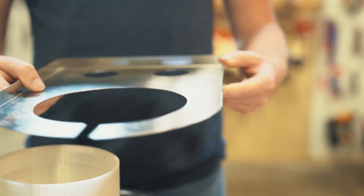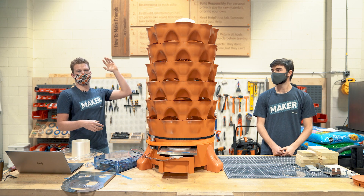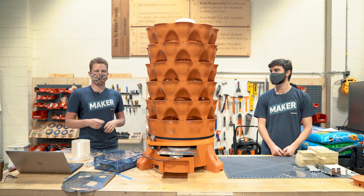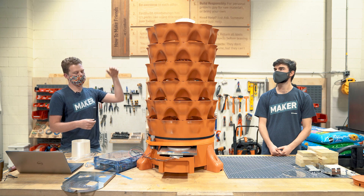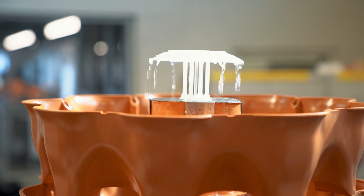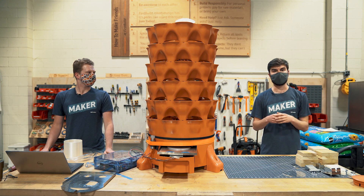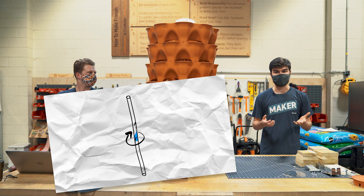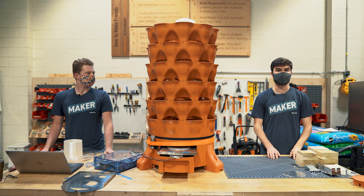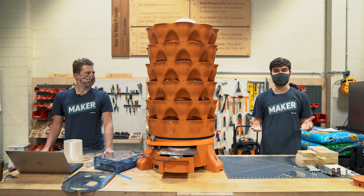Once the water comes out of the tube we have to think about how to get it back down into the fixture. If you take the water straight out of the end of the tube it's just going to shoot straight up in the air — we were shooting water about 12 feet up the other day. So we've 3D printed a custom fixture at the top that acts like an inverse umbrella: you shoot water up into it which then directs it back down into the fixture. Originally the tubing was fixed to the top and it would eventually coil as we spun it, restricting flow. We made a fixture with a hole sized with a little tolerance relative to the tube diameter, so as it spins the tube stays in place but doesn't actually spin with the system.